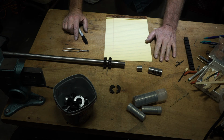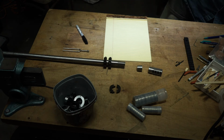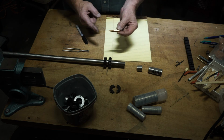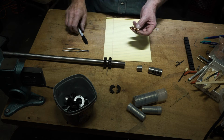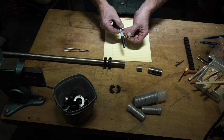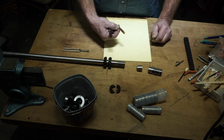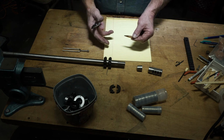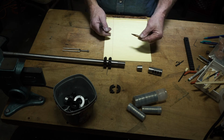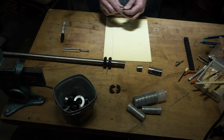Harold Vaughn introduced me to something called the old engineer's trick, in which you exacerbate problems. Let's say you're wondering if tip damage changes the way a bullet flies. Instead of dinking around out here on the meplat, take a file and cut that thing off. Cut that off at an angle way back here. Now send it through the air with a big old... Now we've accentuated the problems of balance and of wind resistance, and now this bullet's going to fly through the air and we can all guess what it's going to do. What's that going to do to the BC? What's that going to do to the accuracy?